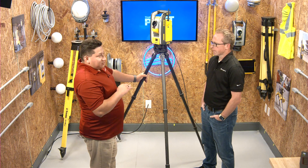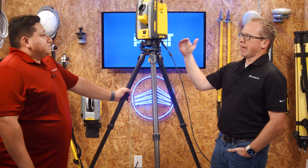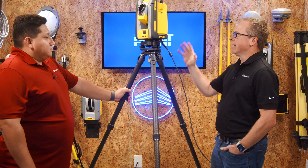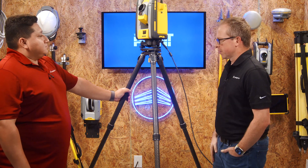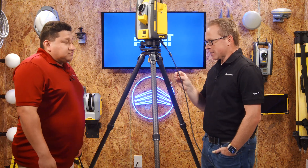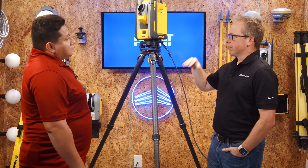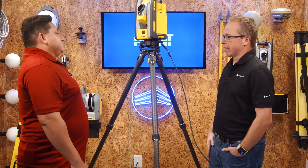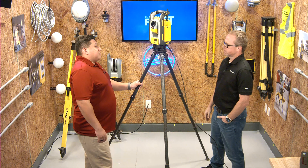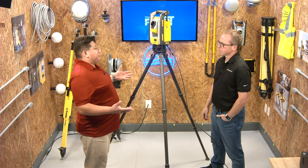Imagine being on a deck — it's going to get a lot more intense. We've actually got it connected up to our service software where we can trigger and simulate jobsite conditions and vibrations. If we listen closely, you can actually hear the legs vibrating, and if you look up here you can see the little end cap is moving because this instrument is fluctuating so hard trying to get itself into a stable condition. That does a lot of damage long-term for the instrument — it's going to create a lot of wear and tear.